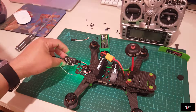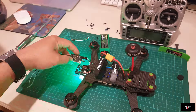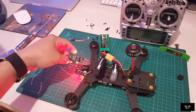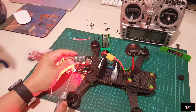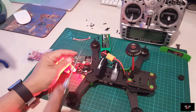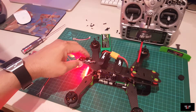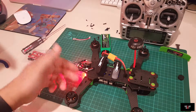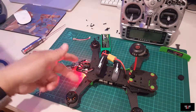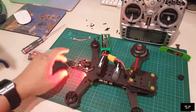You select the bind mode on your radio, and when you connect the battery to the quad, hold down this little button here while you're connecting the battery. That puts this receiver into bind mode and it will bind with your radio - simple step. This is where a lot of people, searching through YouTube videos, just kind of fly by this connection and don't even tell you what port to connect to. To me it's an important step because you cannot connect to the same port for the CPPM.